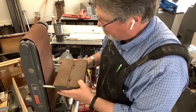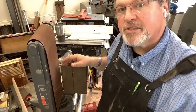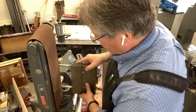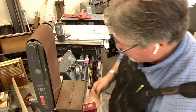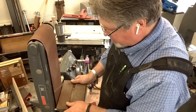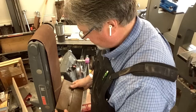The cast iron table can be mounted in a couple of different positions. It can be mounted in holes at about the midpoint, and it can be mounted near the bottom in a similar set of holes. Those same holes can also be used to mount the table sideways to be used kind of as a fence. You can make jigs that mount onto this — an old Sawdust Session by Nick Engler had him and Jim McCann working with a jig that attached to the sander just like this. I'll link to that video in the description. Wherever position you're going to be using it in, just tighten the set screws on the side of the sander to lock against those tubes. If you change the angle of your table, that will change the distance from the sander, so set the angle first and then set the distance from the abrasive.